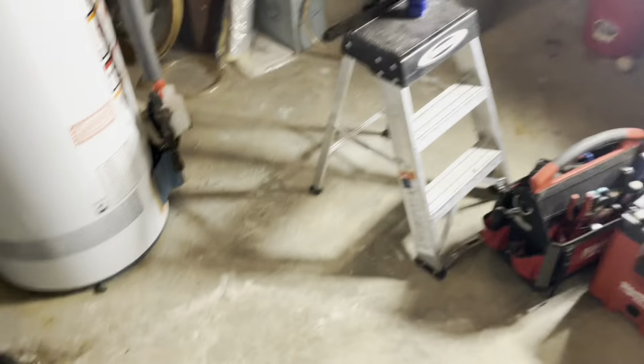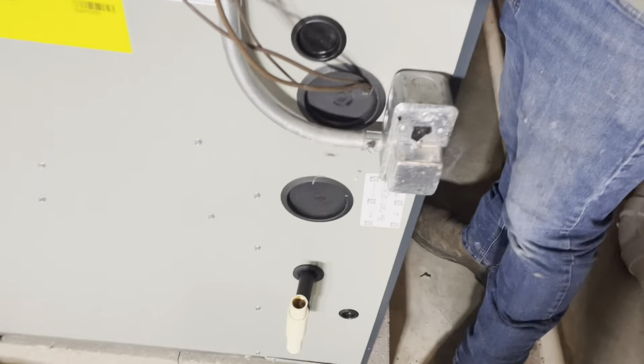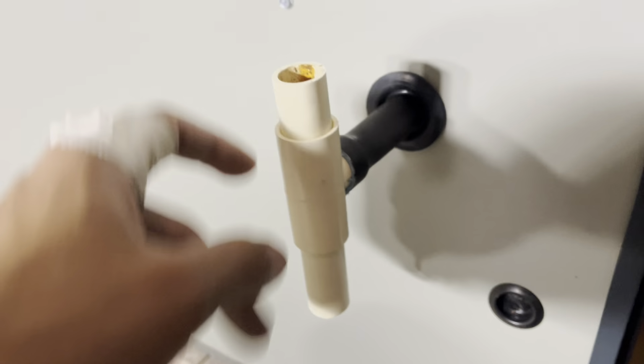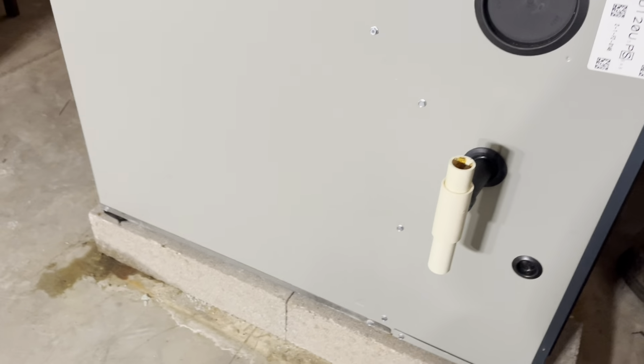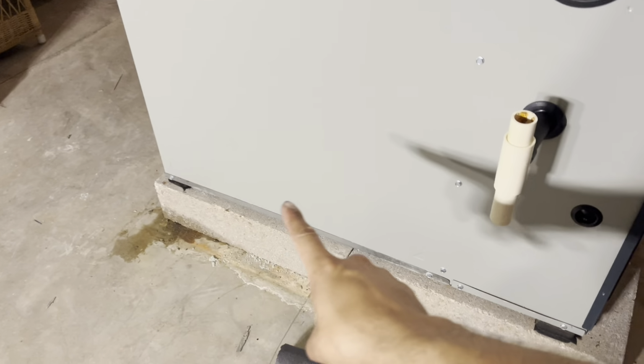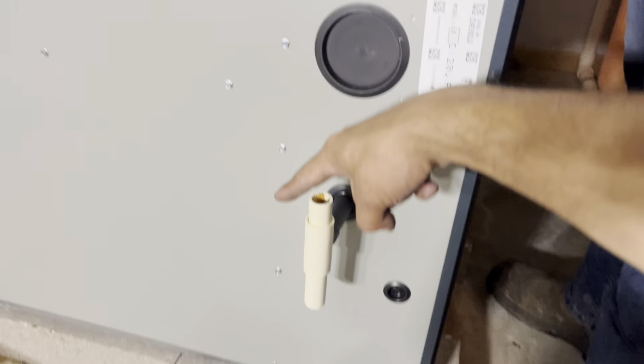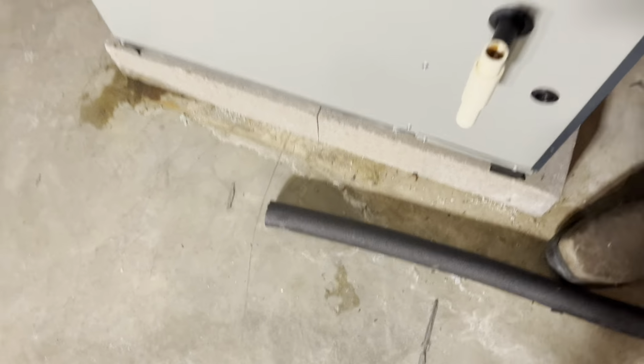This transition, we scrapped it. It's gonna be bigger, taller, better, stronger, faster, better looking, more money. We just decided to cut the drain here and here. We're not gonna redo that fitting. We're really not here for the furnace anyways, but humidifier went that way. We're gonna bring it right here by the bricks, along with our coil. We'll drop it into the top of that. So, get her looking real nice for him.